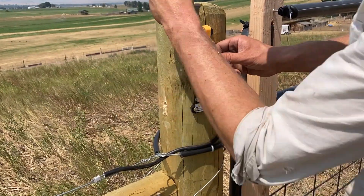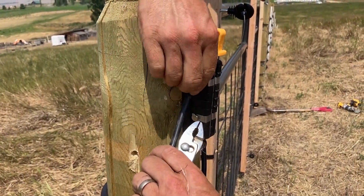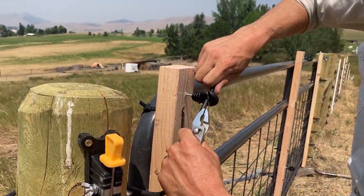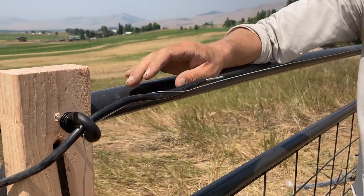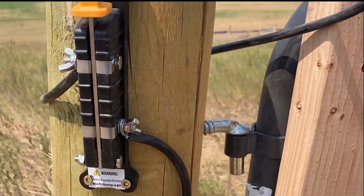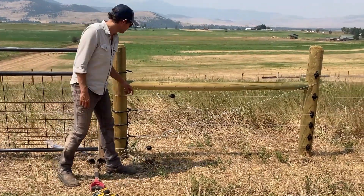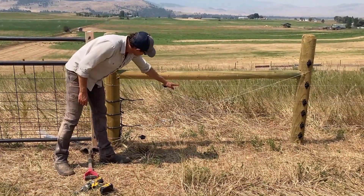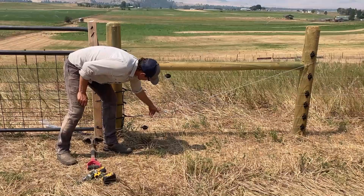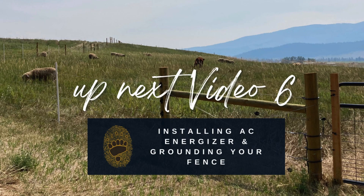Secure the connections with nuts and a pair of pliers on the switch. Make sure your connections are good and tight on the switch. Our fence now consists of two circuits: one connects all the hot wires and is kept out of contact with the soil, fence posts, gates, and other wires. The other circuit ties all of our ground wires together. When we connect our energizer, current will flow throughout the fence.